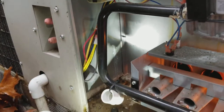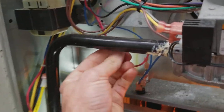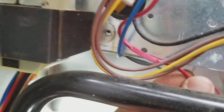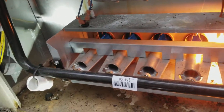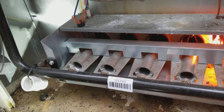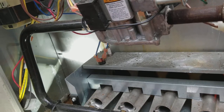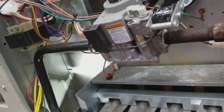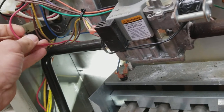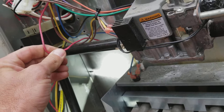I'm hoping the wire is not damaged. Look at that — pinched completely flat. I bet the wire is still good on the inside. I loosened the transformer and now let's see what happens. It shut off. It's flashing four times again. I think that wire was pinched so bad that it's not passing power like it used to.